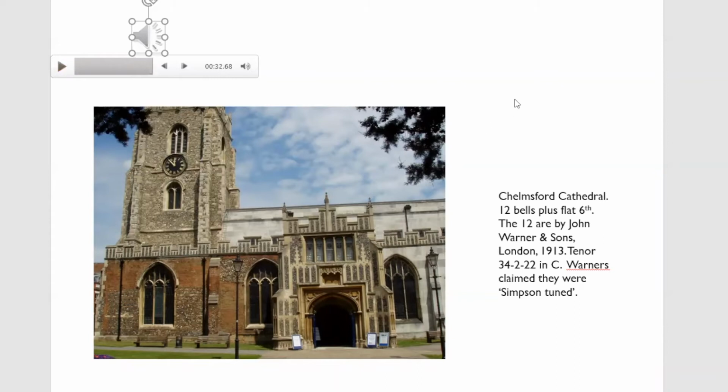A familiar croaking noise from the back bells. The only decent bells, in fact, are 6, 5, and to some extent the 4th. And that's purely by accident, because as the bells were getting thicker, the fundamentals were becoming less sharp. But they're a strange sounding 12. They sound quite angry. They're not easy to hear either, because you've got this clash of harmonics. There's nothing really in tune in these bells, and it's not a happy sound at all.